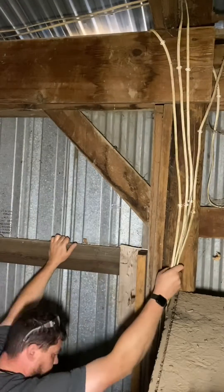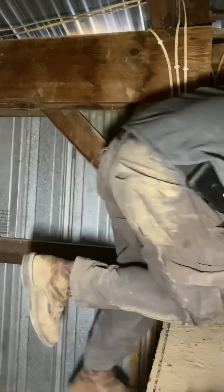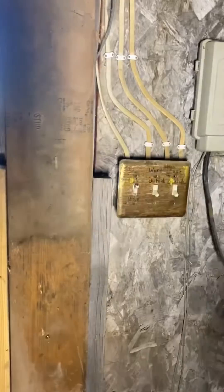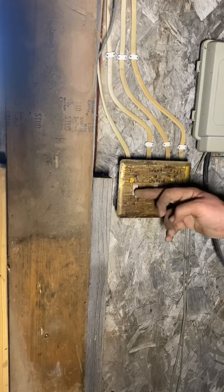At this point the wire heads over the top of a sliding garage door. I trace it out as far as I can on the left, then go to the right side and continue tracing. As soon as I climb up here I realize it goes to the light switches down below. I flip the first switch and the short goes away — and I'm super confused.